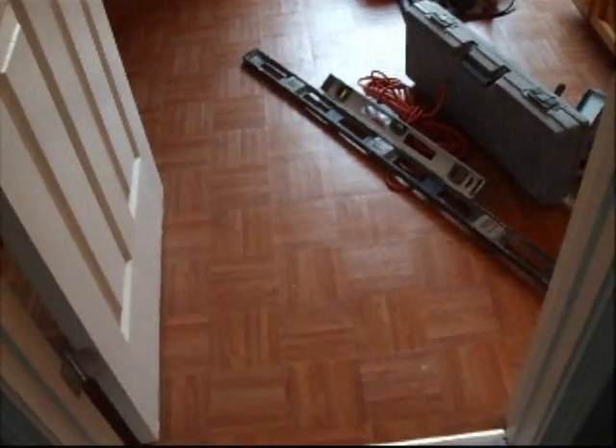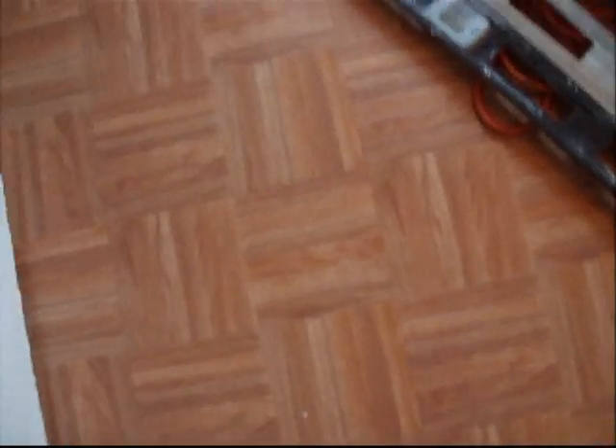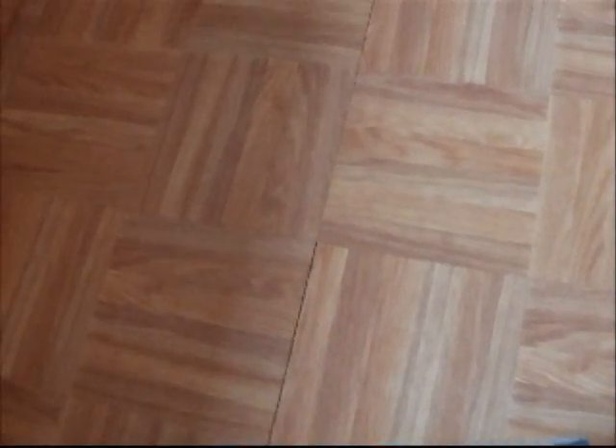We're on day one of this Roswell bathroom. The floor here is kind of odd. It has parquet flooring, but it's not real parquet flooring — it's just sticky stuff. They did a really good job of putting it down, because this house is about 10, 11, 12 years old and there's not too many gaps. The gaps form when the tile isn't butted up against each other, gets hot, and that glue kind of disadheres and you get a separation.